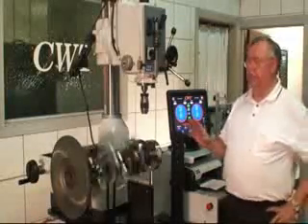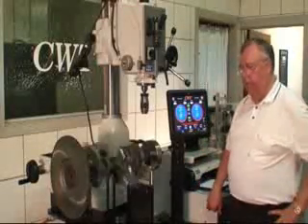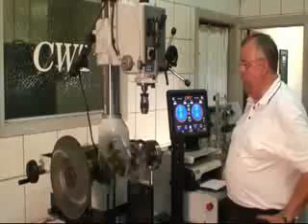Just as a footnote — if there's anything ever wrong, the reason the operator stays on this side is there's an e-stop located right here. That's the panic switch. Hit it and it'll disengage everything, turn the motor off — that's all power. But the computer will stay active.